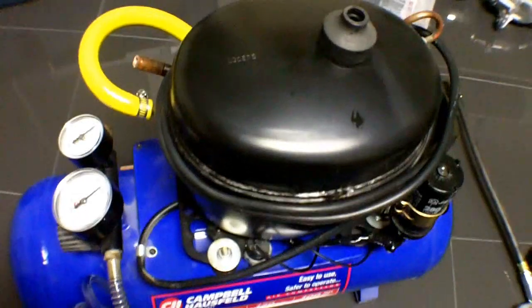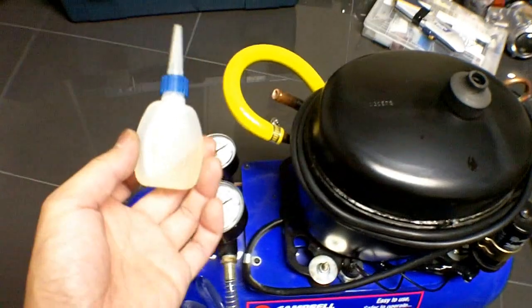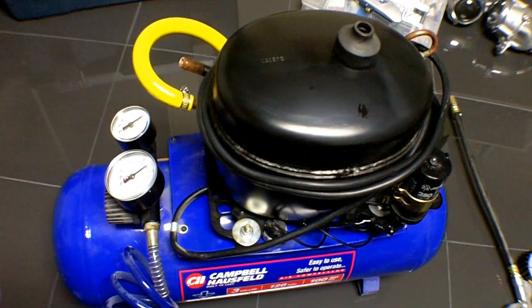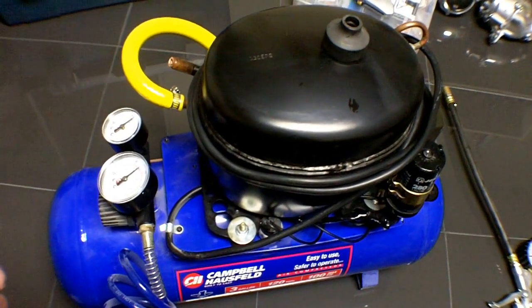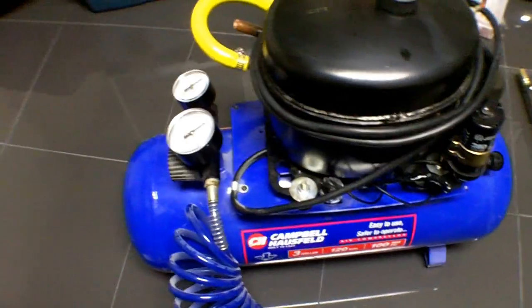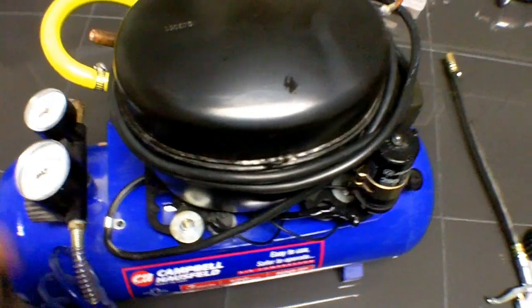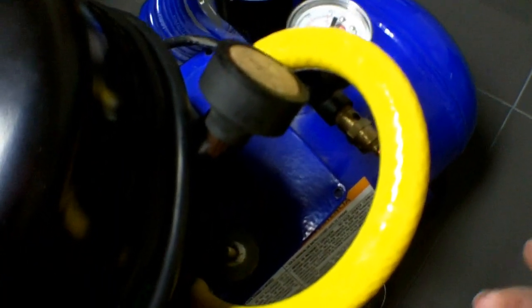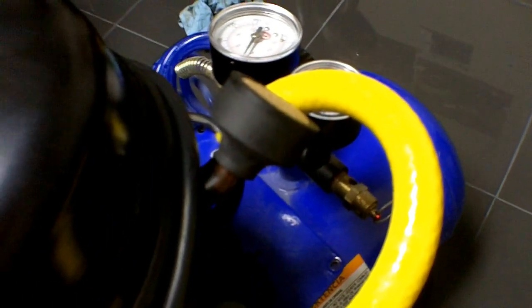From time to time, to keep the compressor maintained, put some machine oil into the intake. Because now this is an open system rather than a closed system, the oil does get used up — it gets deposited into the tank actually. So it is a good idea if you are choosing an air tank to have an oil or moisture release so you can release any oil that gets trapped inside the tank. I've also put an air filter on the top so it doesn't suck in any dirt — this air filter is just a radio-controlled car air filter for nitro engines, and you can get it at any hobby shop.